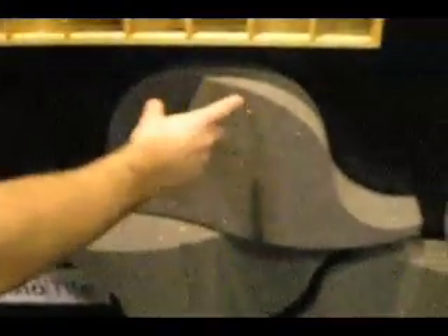The Audio Tile — basically there are four unique shapes and you can make different patterns with them. As you can see in the installs shown here, you can create various arrangements. It has varied thicknesses of foam material, so you get broadband absorption in the thinner sections and effective bass trapping in the thicker sections. The edges also help scatter sound. Depending on the pattern you pick, you'll have exposed hard wall space, which balances everything out — you get reflection, absorption, and diffusion. It's really versatile acoustical treatment.